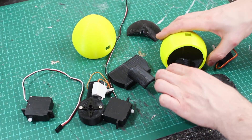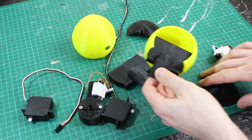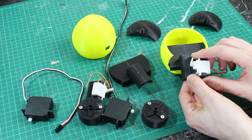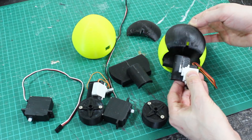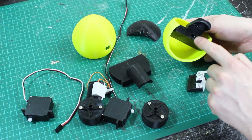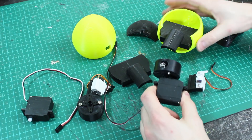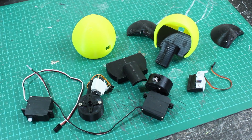Here are some of the eyepieces — we've got these with their gimbal that fits inside there and I can get those in and out pretty easily. We've got the black part that goes on the top to give Bender a bit of an eyelid, and that's got the pivot point in. We've got a servo that will fit on here and that will pivot on the pivot point on the black part to tip that eye around. Meanwhile these rotate, and they'll have a piece of studding in the back that's going to go out to a hub on the back of the eye assembly, and that is going to be plugged onto a servo that turns them so they can both rotate.